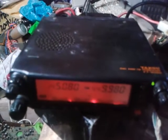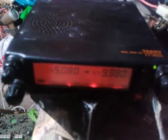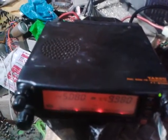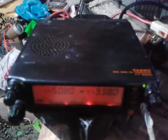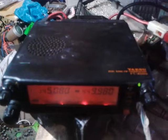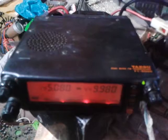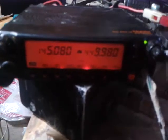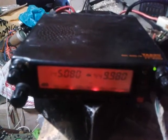The finals of this radio are good — there is no trouble on the finals. The trouble on the TX output power is the driver of both finals. Take note: the finals of this dual band have two different finals, VHF and UHF, and the driver of each unit was already damaged.